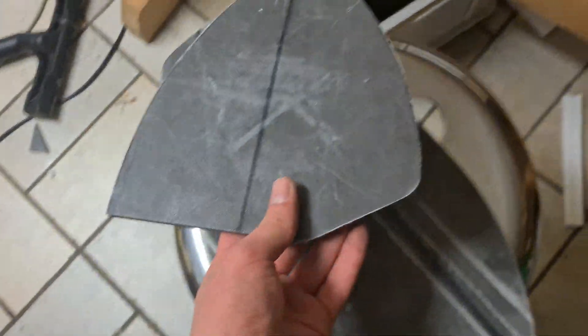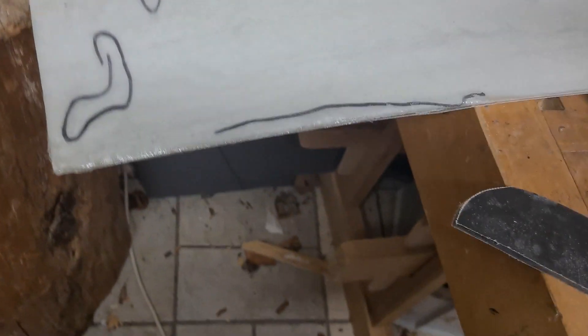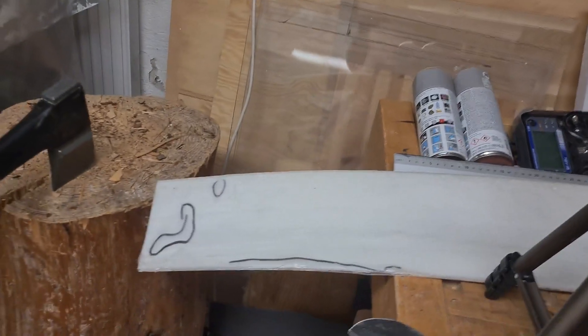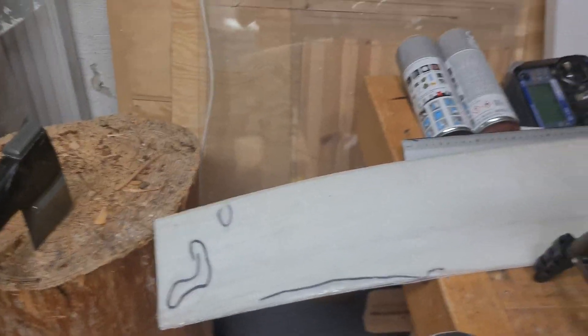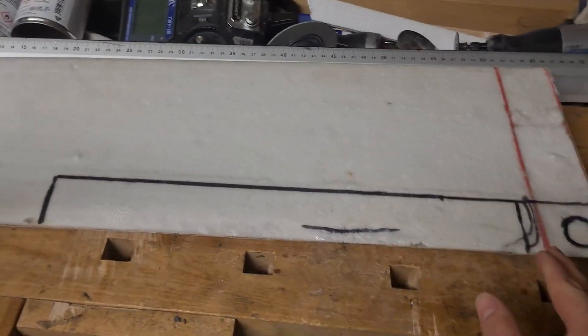This stabilizer has just been finished. They are ready for servo attachment and it's time to make the ailerons on the big wings. Unfortunately we can't place the ailerons at the tips because we made them with a curved shape, which would be quite complex to build there, so we chose to place them inboard instead.